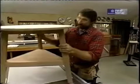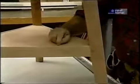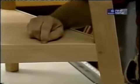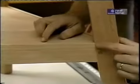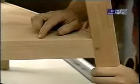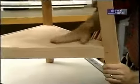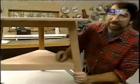Now let's take another look at our prototype. When I made the rails for the lower shelf, I rabbited them only 5/16 of an inch deep. And that's because if I had gone any deeper, I would have started to interfere with the tenons, removing part of that material. It also means that the shelf material, or the wood, can only be 5/16 of an inch thick.